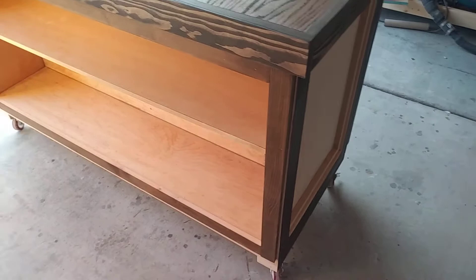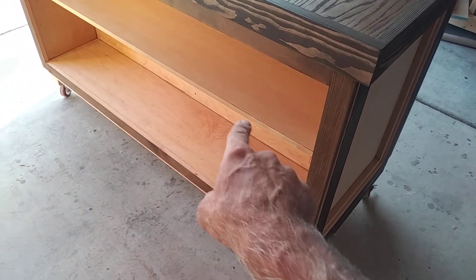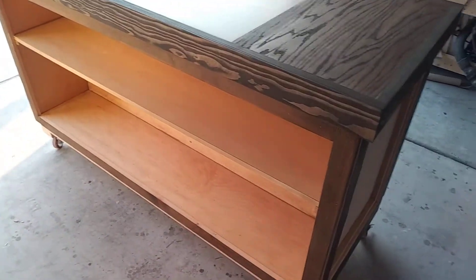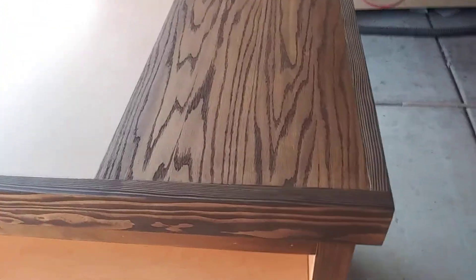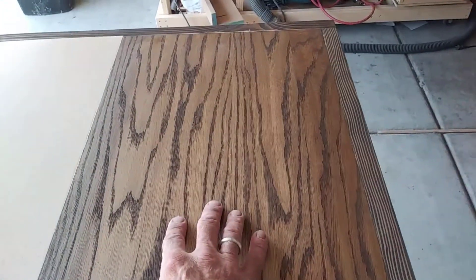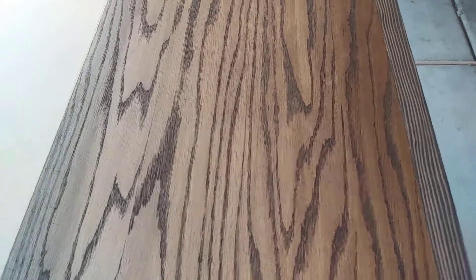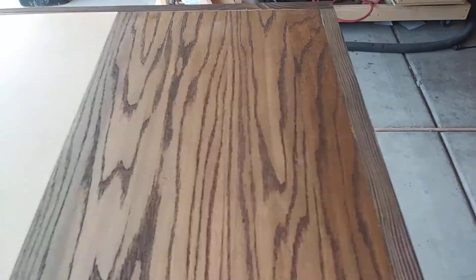I'm really trying to get a contrast. This is actually going to get a piece of wood going across it after I make the center divider that's going to go here. But before I do all of that I'm going to re-stain, go over it one more time. This was stained with dark walnut on red oak, which is several panels glued up, and it turned out really well.